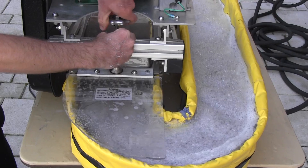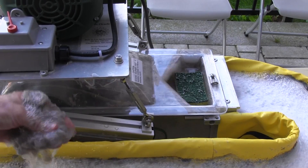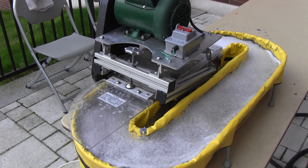Step one, liberate the rag. Take a razor roller and scissors and cut up the uniform, and you separate all the buttons and zippers and things that can't be made into paper, then put it into a hollander beater and that will basically chew it, beat it into a pulp and separate the threads and then the threads into fibers.